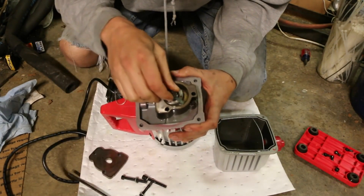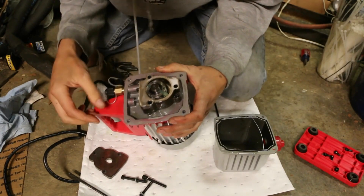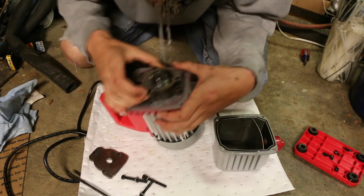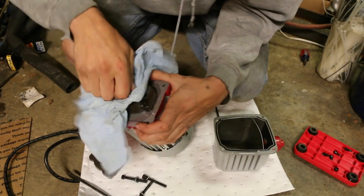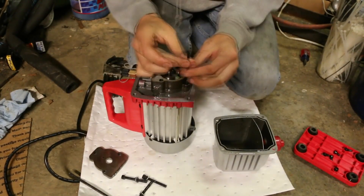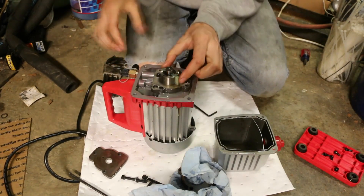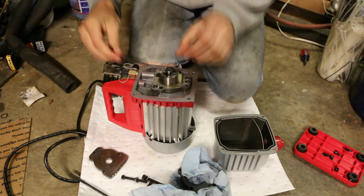So this has a plastic component in here. It's meant to slide or rotate or do something, and it is not. I think I see what's going on — there's a burr right here on this side. That whole housing piece comes off right there, and then this piece should be able to be slid back and forth because there's nothing seized there other than this little area here.